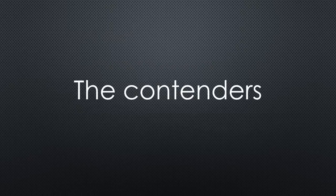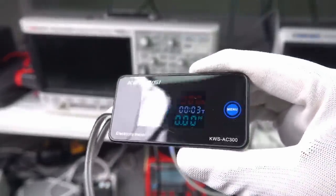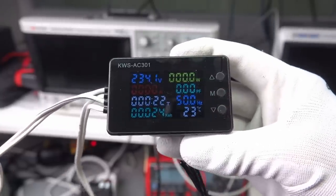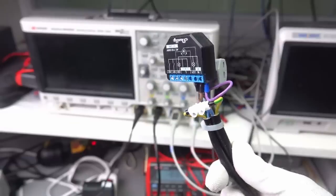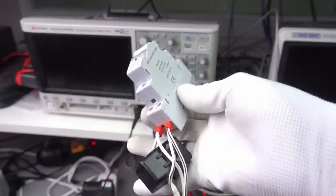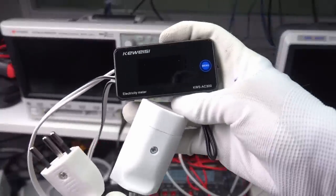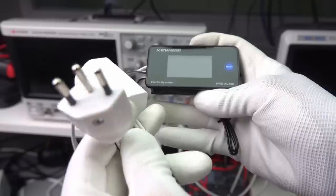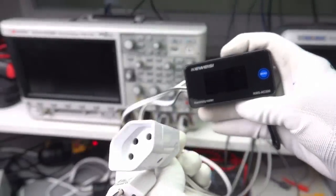This is the selection of meters: a simple KWS AC300 manual power meter, a KWS AC301 with an RS485 interface, a Sonoff POW Elite, a Shelly Plus 2PM, a Tuya meter with Zigbee, and a Tuya meter for DIN rail mount. I did not select plug meters because most are incompatible with our connectors. So I connected cables with the correct connectors to all meters — they are also readable in hidden places and can easily be used for permanent mounting.